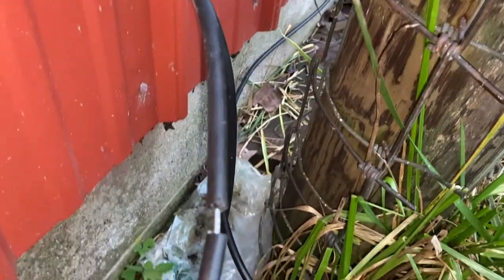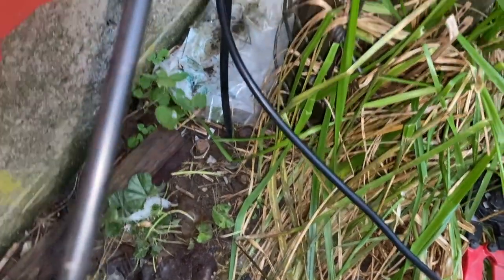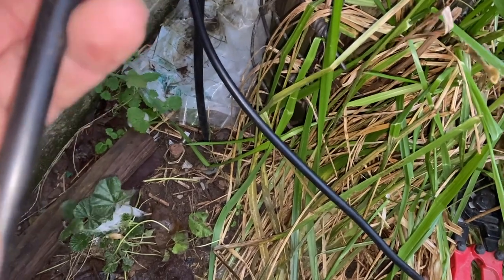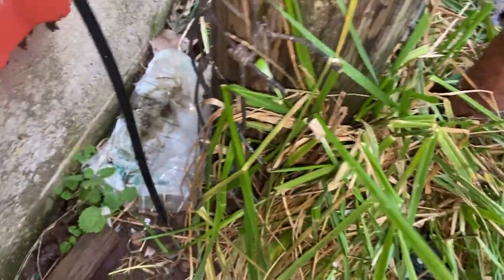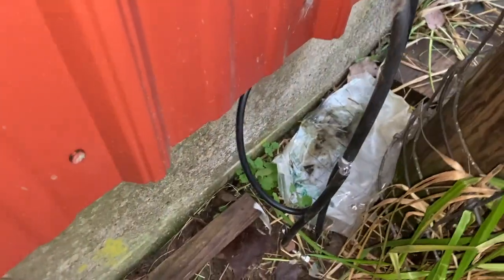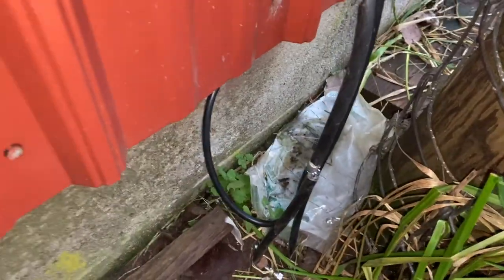As I go ahead with this work I don't want to rely on that contact to send the signal. I'm going to crimp this on, cut it shorter, and attach it properly to the grounding rod. I got this connected over to the grounding rod and adjusted and fastened down. This other wire is the hot line that goes to another part of the fence that I disabled so the kids don't get shocked because it's near the playground. Now I'm going to plug the energizer back in and see how the fence is doing.